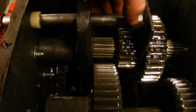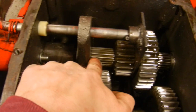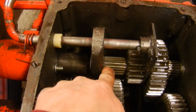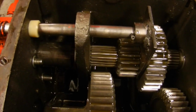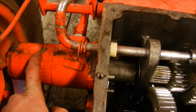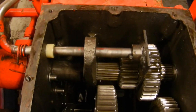You probably can't see the spline down in there that goes to the hydraulic motor, but that's not spinning, and this is also walking around. I don't know if this spline that I can see here is actually attached to this shaft, or if the spline sticks into the end of this shaft, but either way something sheared in between this piece right here where they both connect. So in order to get this out, what I have to do is pull the hydraulic motor and the lines off, pull that out, and then I can remove this shaft here. So we're gonna get all this disconnected, pull that out, and see what the story is on this piece right here.